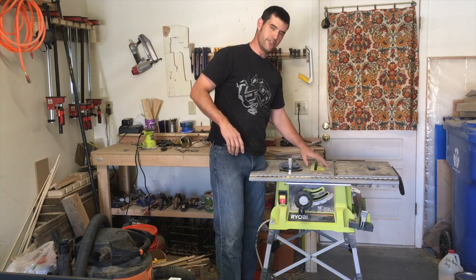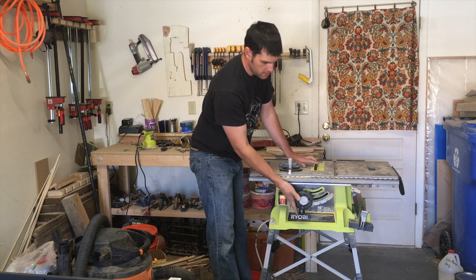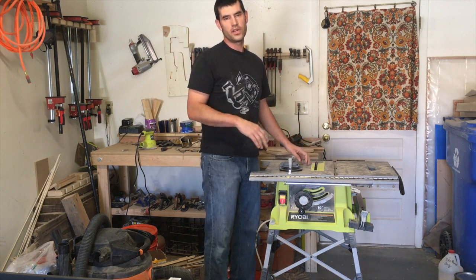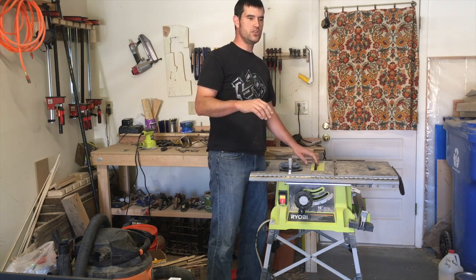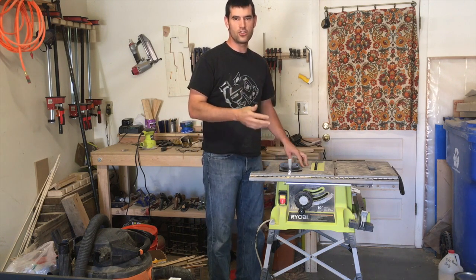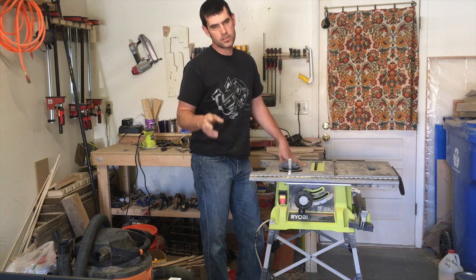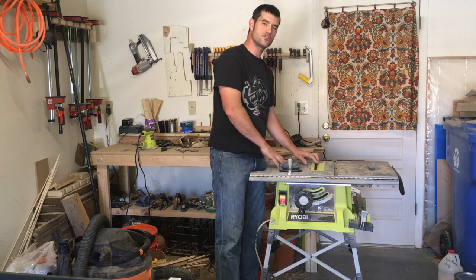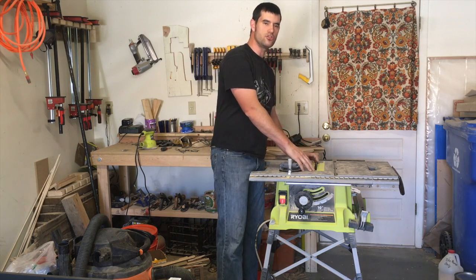One thing I found is that when using very dense, thick hardwood stock, the friction against the fence pushed the blade and carriage unit a couple of degrees out of skew, so I cut a bunch of wood that wasn't exactly at 90°. That happens more with dense hardwoods over about one and a half inches thick. But with finished wood from Home Depot at three-quarters inch, I didn't have any problem — it stayed at 90° and worked just fine. With poplar, alder, and pine I never really had issues either.